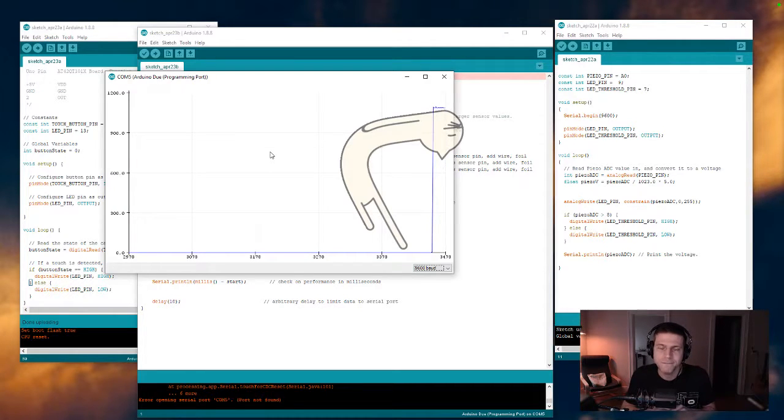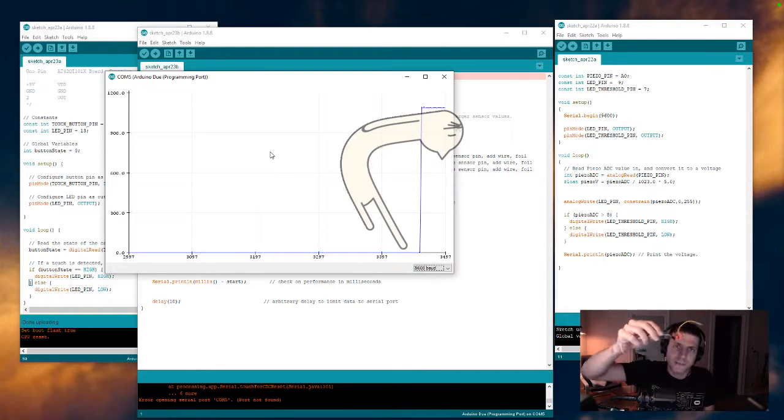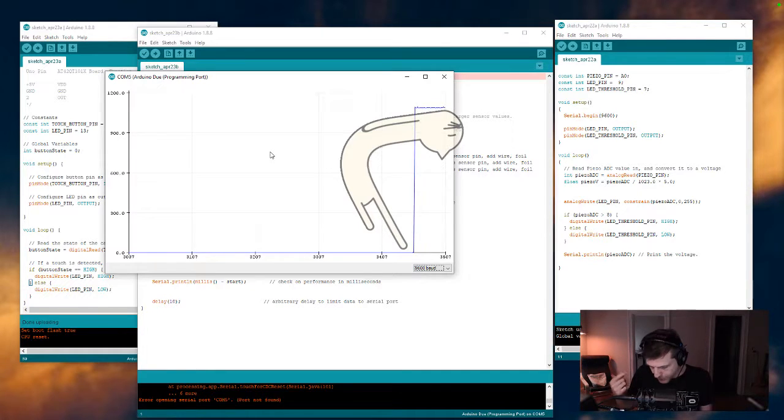I'd have to refresh my memory on the exact principles here, but you're kind of sucking some electrons into your big, wet, gross body. And capacitive sensing works just by saying, oh, something is sucking electrons into its big, gross, wet body. I should do something. So that's how this little dude works. This is a specialized chip for that. But this library for Arduino is able to use features of the microcontroller, which in this case is a little Atmel chip of some flavor, to do essentially the same thing.